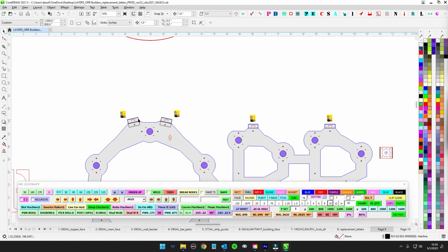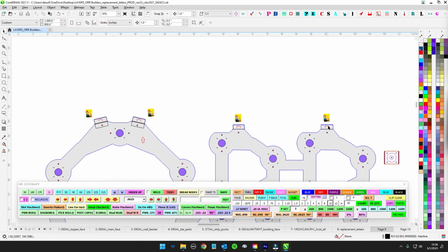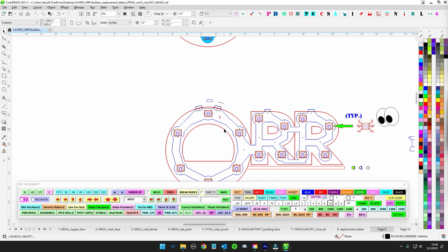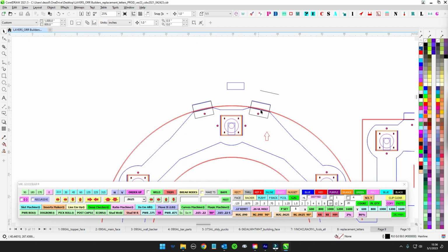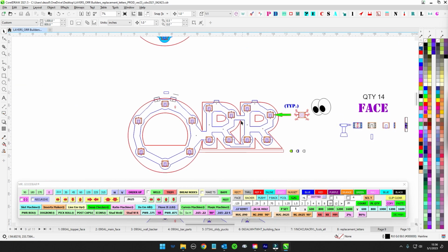You'll see that when you do the backer, you're going to hand bend these up to 90, and this is how it gets secured on. Once the system gets slid onto the backer, install can just hit these with self tappers in these 4 spots, and it'll keep this from ever lifting up.